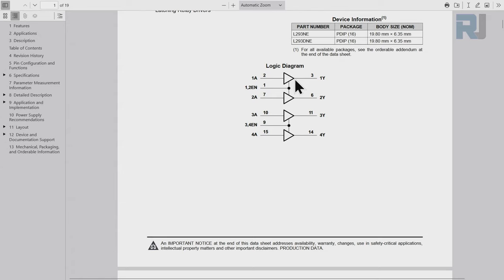To change the direction of rotation, set channel A to zero and channel B to whatever value you want - for example 100. Upload the code, disconnect, connect the 5V back, and the motor now goes in the other direction - counterclockwise.